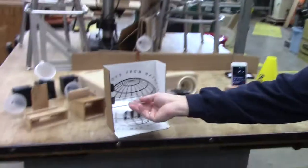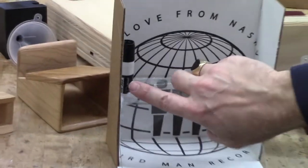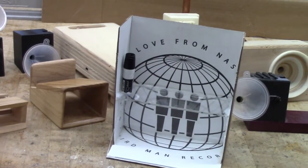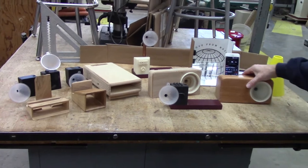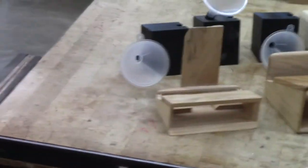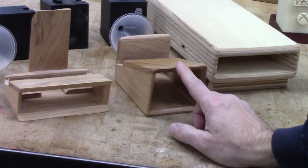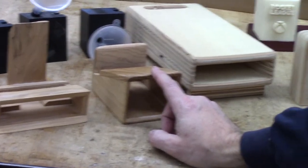I was messing around with this design the other day and it ended up being a failure. These little tiny speakers — this was supposed to sit up here with the sound coming out through a hole, using an old dried-up expo marker as a channel. This speaker just doesn't generate enough sound pressure to force the sound down that hole, so this is a failure. But I noticed that just putting it on this shelf made it sound a little better, and I realized these designs are really more of what you'd call a band shell.